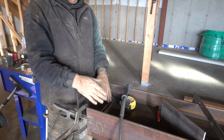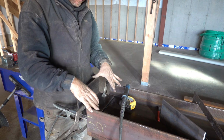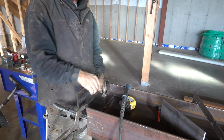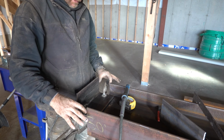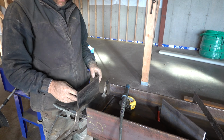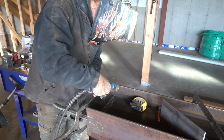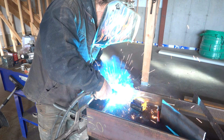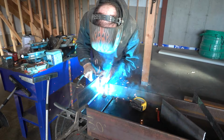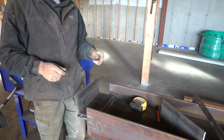I cleaned the metal. It has bolts, which do most of the structural work, but I'm gonna tack them in place, and then I'm gonna tack the bottom and the top. Then I'll drill my holes through all three, and everything will be perfect. I set those at 3 3/16 out. So it should be just perfect. Should be. Right, I'm gonna put the beam over, put the other one on.